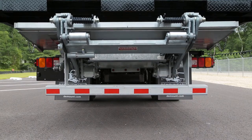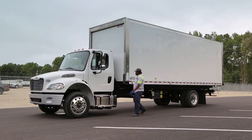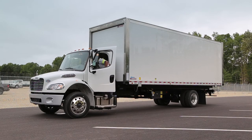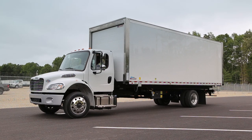If your truck is equipped with a lift gate, raise and lock the gate in its normal ride position. If other people are helping, be sure everyone is standing clear. Return to the cab and inflate your air suspension if dumped. The truck is now ready to be driven.